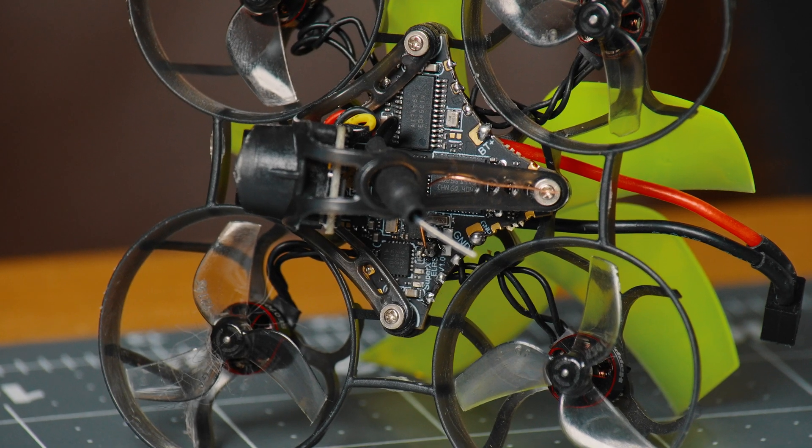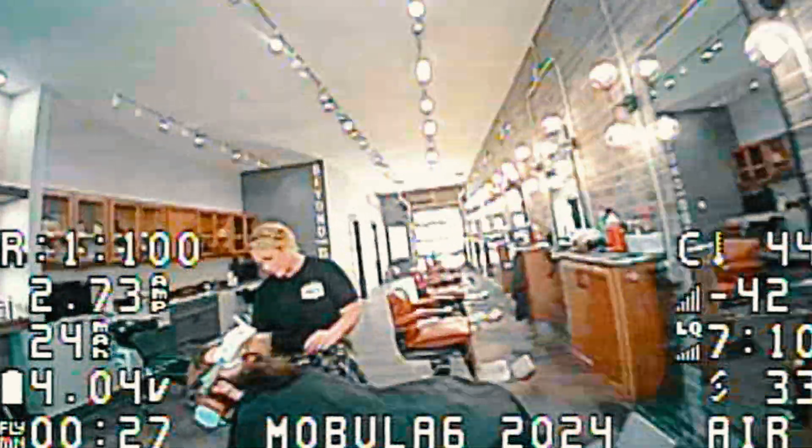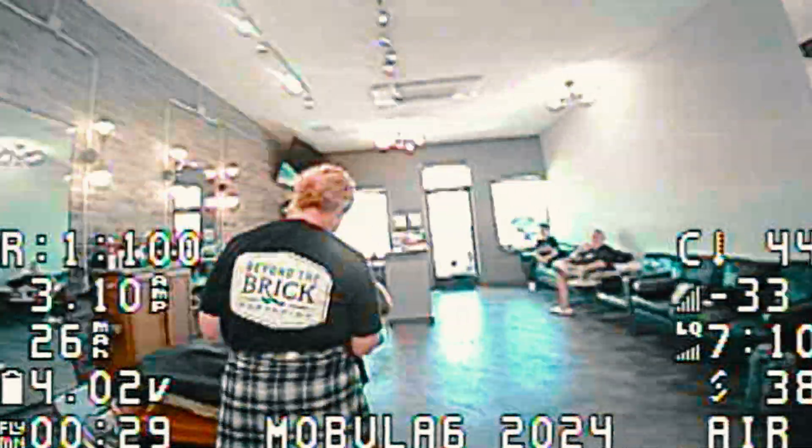The reason is that transmitting an analog video signal is easier than a digital one and requires fewer components, making the drone smaller and more lightweight. This camera is for you to be able to see where you are flying — it's not meant for recording footage. Of course, you can absolutely record the footage, but you won't be winning any awards for the quality of the image.